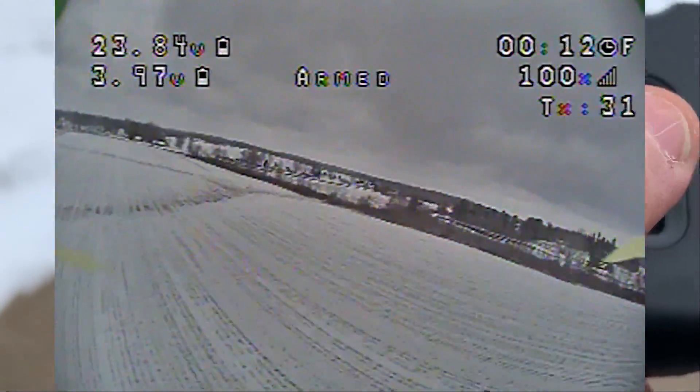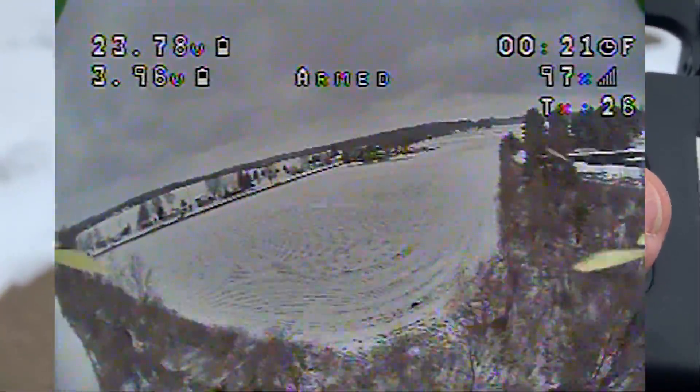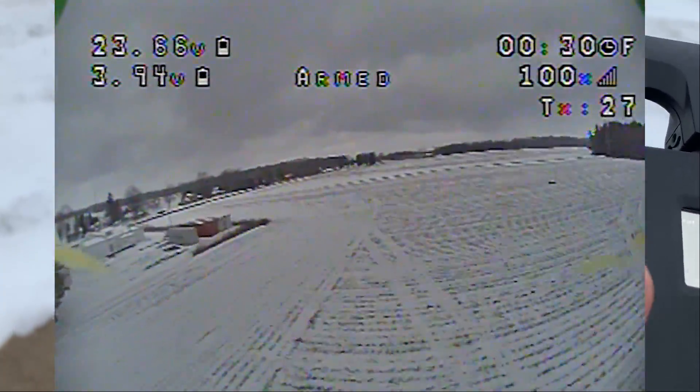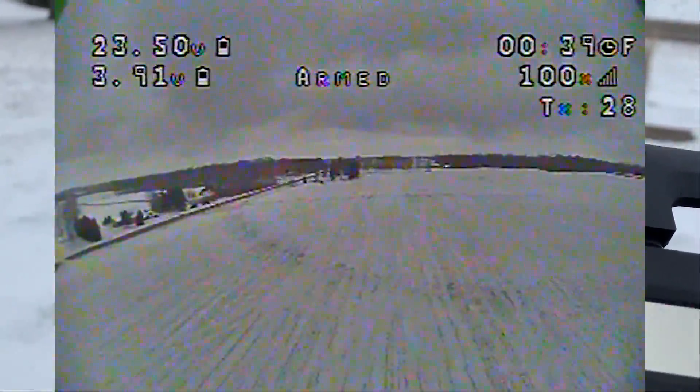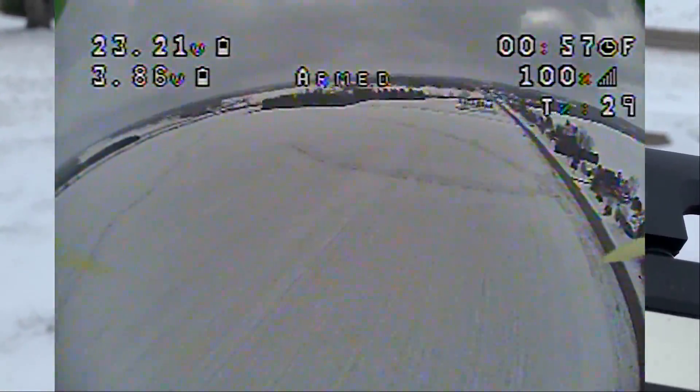250 milliwatts, 68 dB. Now 72 dB. We've already dropped out of mode 2 and we're in mode 1 at 73 dB. Continuing out — 79, 80, 85, 96 dB. Back down to 92, 91 dB. RF signal critical — 89 dB. Doesn't feel safe. 93, 90 dB — oh no. 98 dB. 83 dB — that is not what we wanted. 98 dB. That's a failsafe.